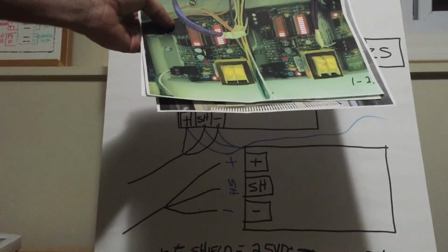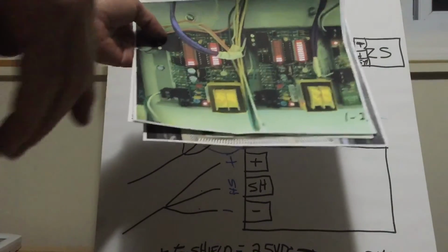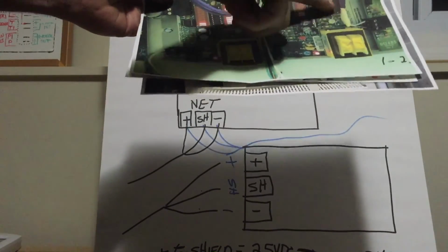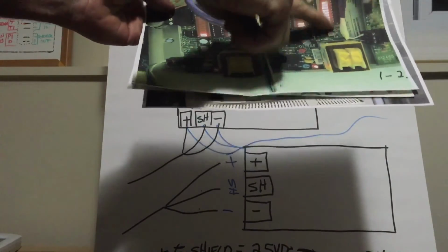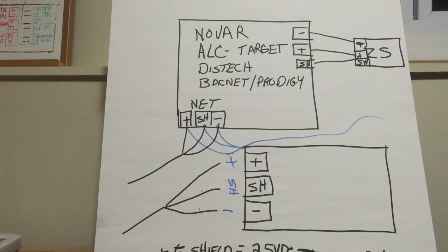You've probably got a unit off on the roof or a cable cut or something going on, but these should not be jumping up and down like you're cranking AC/DC on your equalizer. They should be at a level and maybe bouncing just a little bit, but if they're going from top to bottom in a continual heartbeat, that means they're resetting and there's a lot of noise on the line.